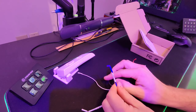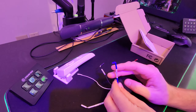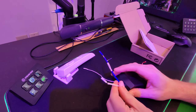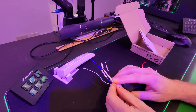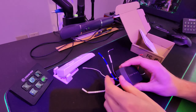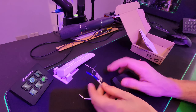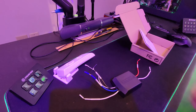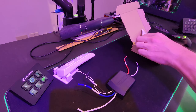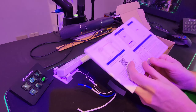Please keep that amp limit in mind — otherwise you might have a fire or blow this thing up. The black wire hooks to the fan motor. For the lights, if your fan has them, the blue wire goes to the lights and the white wire connects to the neutral. If your fan doesn't have lights, just tape that wire off. Hook up the wires, hide everything, and then I'll explain how to set it up on your phone.